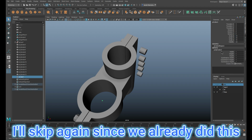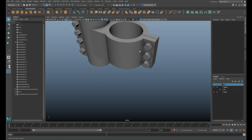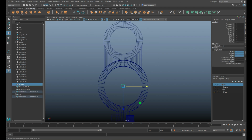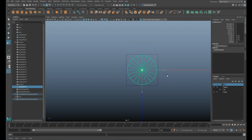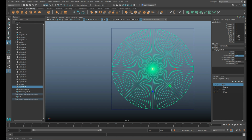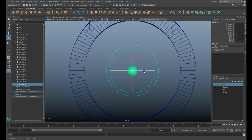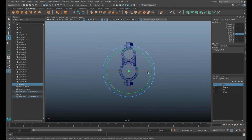So I'm going to grab a measuring cube. Okay, and last but not least, we just need to create a hole for the screw to go through. We have a 4.53 millimeter screw in diameter, the neck of it. So I'm just going to make a 5 millimeter hole for it. So let me grab a measuring cube, do 5 millimeters. And then I'm also going to create a cylinder, because that's what we're going to need to let the screw hole go through. And I'm going to make it 100 as always. And let's give it its space that it needs. So I can go 25. Very nice. All right, I could delete the measuring cube, rotate this 90 degrees, and just make it long.